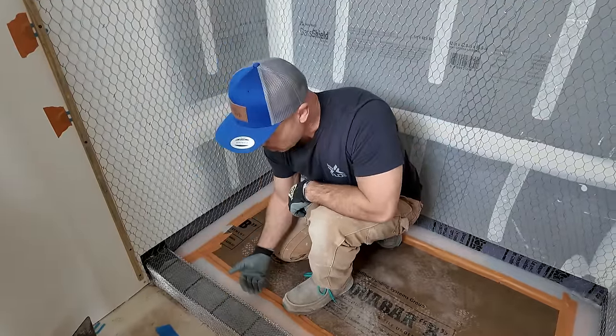Yeah, I didn't want to go too thin because I got a half inch here for my tile ready niche, which has about a half inch profile. So if I got my float strip sunken in too deep, when I went to screed it, I would have hit the niche, but I'm just about perfect. Just about perfect. You see, I didn't put quite enough mud on.